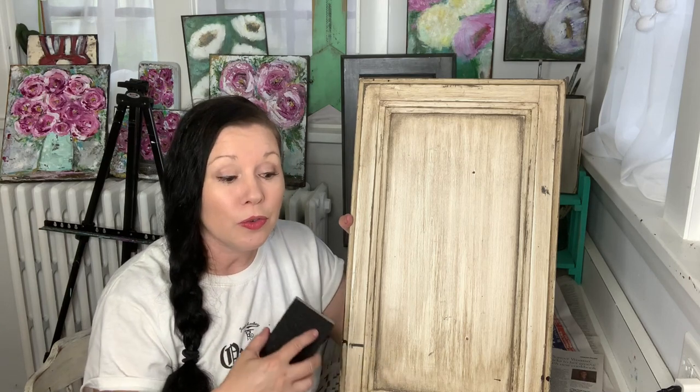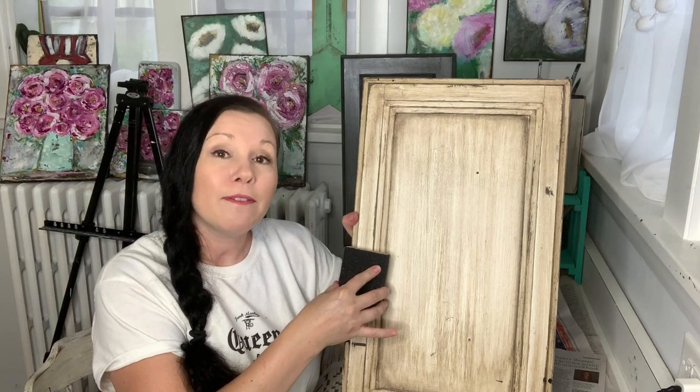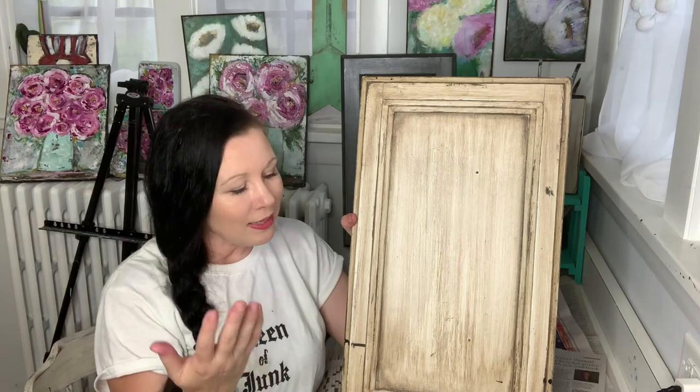Now, if you're painting kitchen cabinets that have already been painted and you're not sure what kind of paint is on it — that's the beauty of Junk Monkey, it will stick to it. But be aware: in my home there was an enamel type paint. Junk Monkey is not an enamel type paint and it's not a paint that will chip and flake. But if you see a lot of flaking and chipping, that's usually a clue that the existing paint is failing. When you take your sand block and do that process, you'll encourage those weak paint chips to come off now. Otherwise, when you put Junk Monkey on, it'll stick to the flake, but the moment that flake gives way, anything attached to it will fall off too. So make sure anything that wants to come off does so now, and then you can paint and feel good.